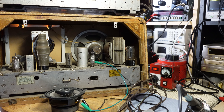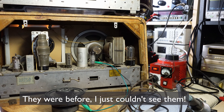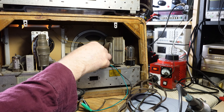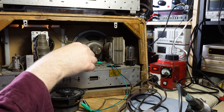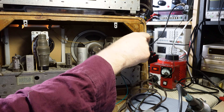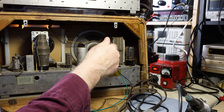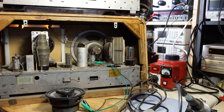I think I've worked out what the missing valve was — it's a 6AQ5. And the dial lights are now lighting up. Don't have any sound at all. It's only at 120 volts or so. No heat there, no heat there — it's getting warm. I'll bring it up a little bit further. None of these are glowing other than the rectifier valve. Now I have to be super careful with this because the output transformer actually has B-plus on it.